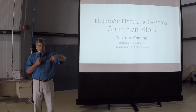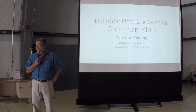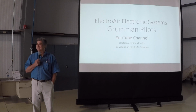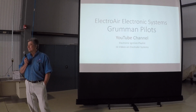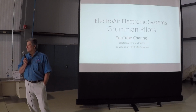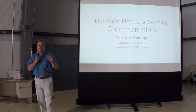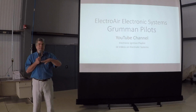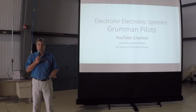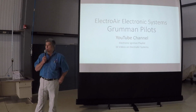Their original design had a generator inside what they call the SIM. So anyway, SureFly with their SIM, I think it's a SureFly integrated module. Their original design had a spinning generator inside, which they've now taken out. Yep. They were going for the dual mag solution. Now they're just going for the simpler mag, electronically fired. So again, you'll have one mag on the engine, and when they get certified, you'll have one of their electronics.